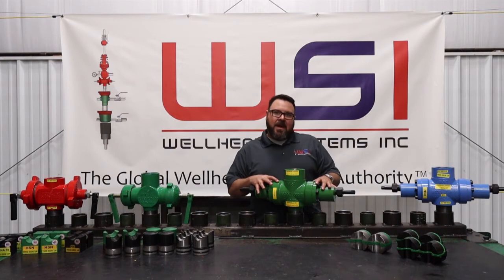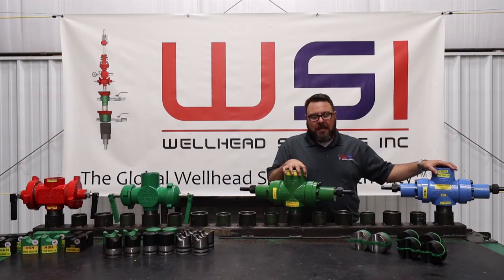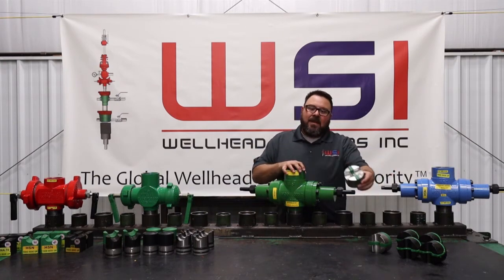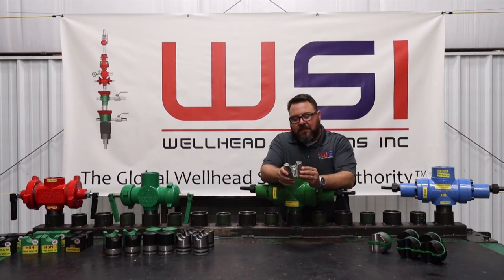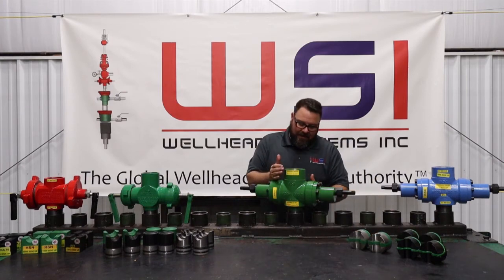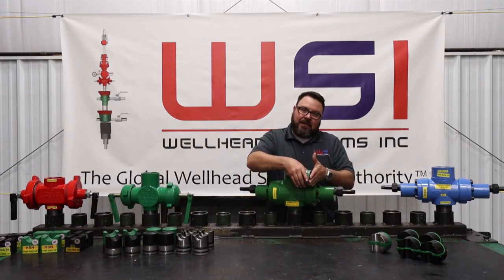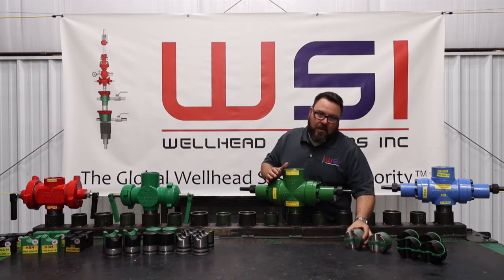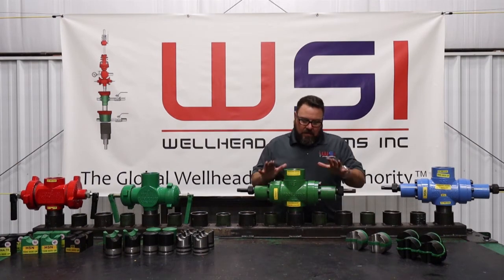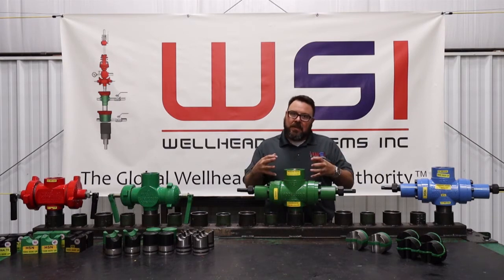When you jump up to the 3,000 pound and the 5,000 pound rating on our T models, you get a pressure balance ram. What that means is when we machine these rams, there is a flat spot machined on the bottom. As your wellbore fluid builds up, it allows fluid to come up from the bottom, come underneath your ram, and assist in shutting in the BOP rams and sealing on the polish rod. It allows you to only have to apply about 50 psi of pressure to the ram bolts to get them to close and seal. It helps with those higher pressures because you get a mechanical seal with your ram bolts as well as a hydrostatic seal with the pressure balance system.